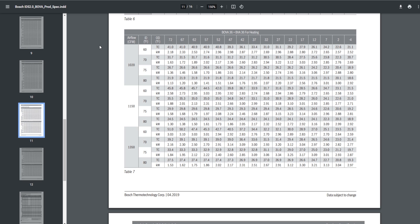It's one of the protections it offers, because at negative 4 you're in real danger of going so low in the pressure category that you're going to end up damaging the compressor — the pressure goes down, temperature goes down, might be slugging the compressor. There's all sorts of hazards right there, so you'll switch to electric heat. Resistance heat isn't very good for energy efficiency, but the good thing about it is it's simple and it doesn't depend on the outdoor temperature. It's just heating up the air as it passes across it — no refrigerant flowing. It can be a lifesaver in certain instances.